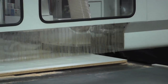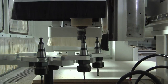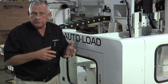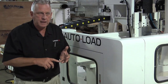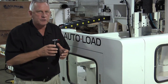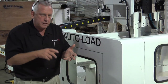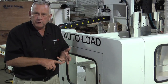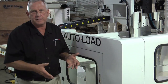If you're watching the video, this machine is unbelievably smooth — quick and fast to accelerate. That's due to the motion control systems. It's servo-driven with closed-loop servos connected to planetary drives, which are very smooth. We're driving with relatively large pinions, and like all SmartShops, you've got helical racks, very good contour guide rails, and ball screws. All those things contribute to how well the machine performs.